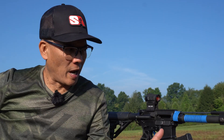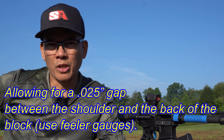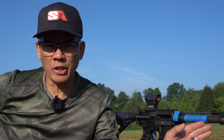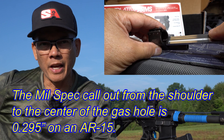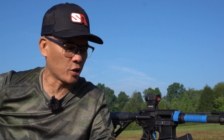We're kind of looking at the science behind this piston kit. Before we go into that, a couple of things about their specific kit. Number one, one of the biggest problems folks have — not just with piston kits but actually gas blocks — is that they do not align the orifice on your barrel with the porthole on the gas block. What I've done is fairly simple: just take a set of calipers and measure the dimension from the shoulder on your journal to the gas port on your barrel. Take that dimension, look at it on your calipers, and then measure the dimension on your gas block. Hopefully those will line up — that's a huge thing, you've got to make sure you get that correct.